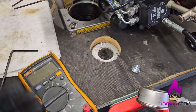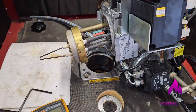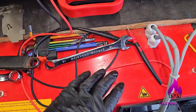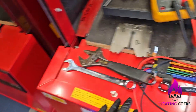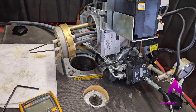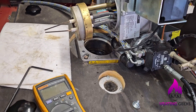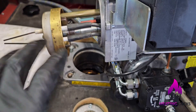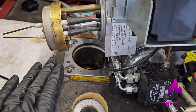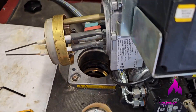Which would mean it's been like this since — I don't know when — but this boiler has a thousand fewer hours on it than the other one, so maybe a year. It could be since it was last serviced and it was put on wrong. That's why I mark things when I take them off — because if I hadn't marked that, I would have just put it back on and not realized it was in the wrong place to begin with.